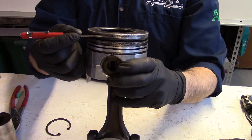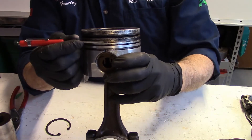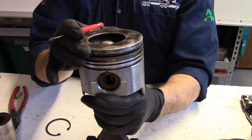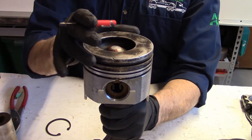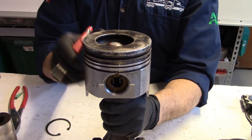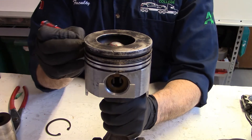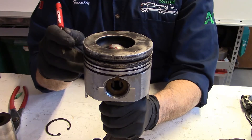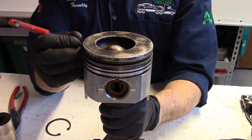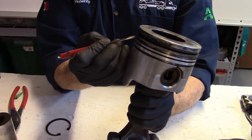This entire space from the top surface down to the bottom of the oil control ring groove is referred to as the ring belt. The ring belt is slightly smaller in diameter than the skirt from side to side, and the reason for that is it is the rings that are in contact with the cylinder in this ring belt portion, not the piston itself. On the piston, these are referred to as lands.